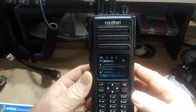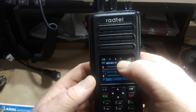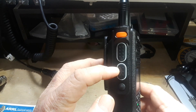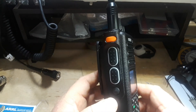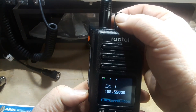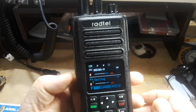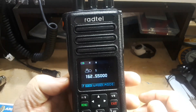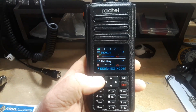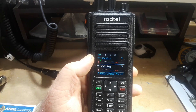Taking a look at the screen and front panel tells you a couple of things. Number one, it is dual watch — that's what this little mountain-looking icon is. It is dual watch, cross-band or same-band. Very nice. To go with the dual watch, you also have two PTT switches and two programmable switches. This switch down here on the bottom — a quick press takes you to your weather frequencies, which you can scroll through with the VFO knob. Press and hold, and that kills your squelch. Very nice. You have your A-B switch here, which sends it to whichever VFO is your main one. That is the only one you can program, so you need to make sure you're paying attention to that.